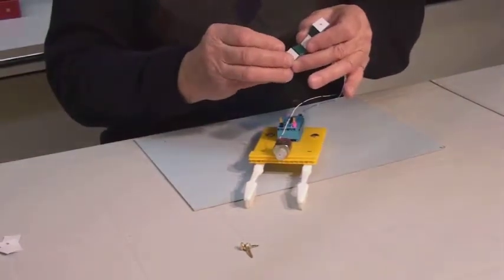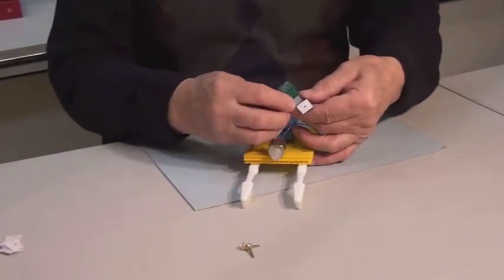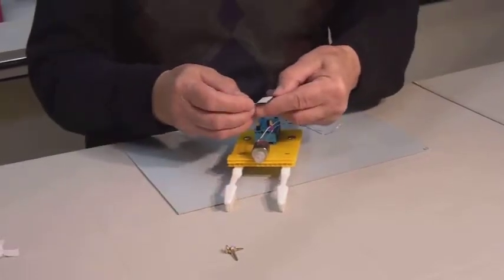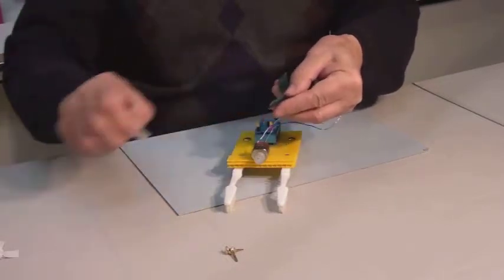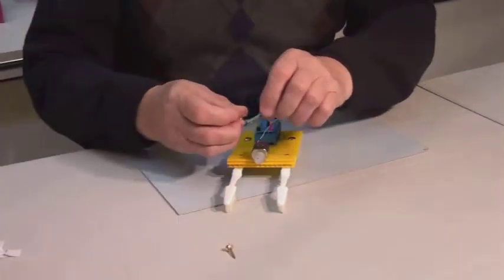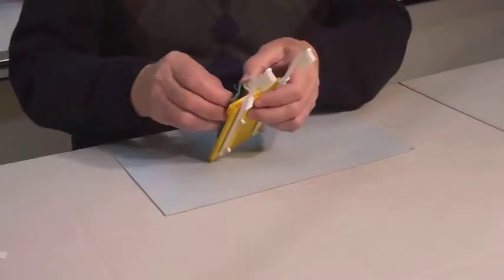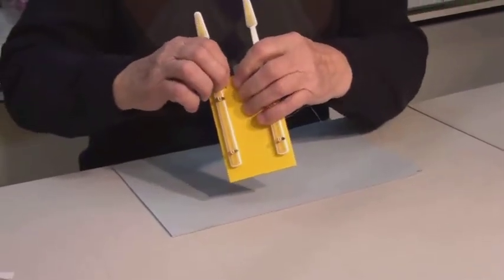Remove adhesive backing from the harness. Insert our paper fasteners halfway into the holes in the harness and guide them into the openings in the support plate. First on one side, then on the other. Bend the legs of the fasteners.